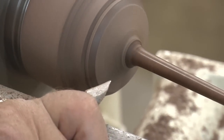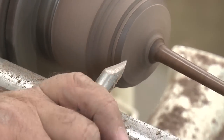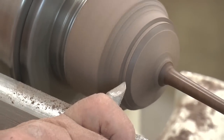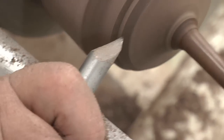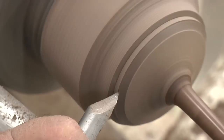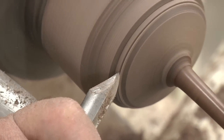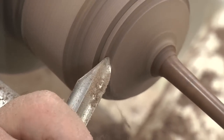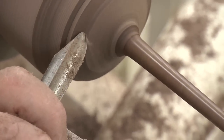Now I'm going to do an OG shape towards the stem, and as I go in almost at a 90 degree angle, my bevel is going to be close to 90 degrees. That's what I'm going to use as my guide. Again, you can see I want to be on the other side of that crown, so my tool almost looks like it's upside down. I overcompensate a little bit, and as I rotate it back, you can see where it starts to cut. Once I get past the shoulder, I open the face a little, and I can get more of a cutting edge. So I can go in with my shape.